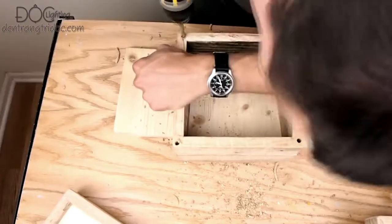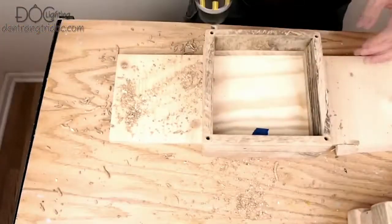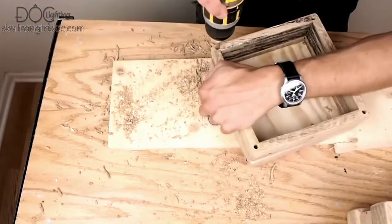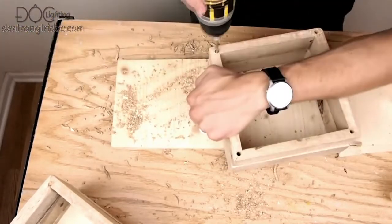I wanted the ends of the rod hidden, so I didn't drill all the way through the wood on the top and bottom layers. I only drilled 1 inch deep. I used the 2nd layer as a guide for the bottom. I used the 4th layer as a guide for the top.